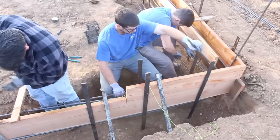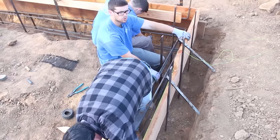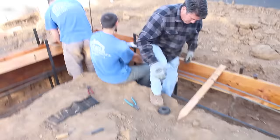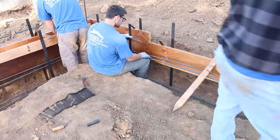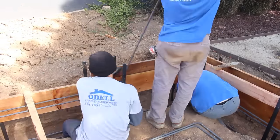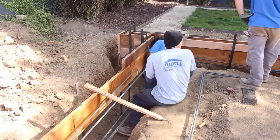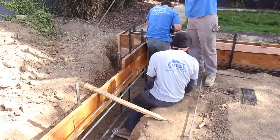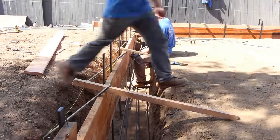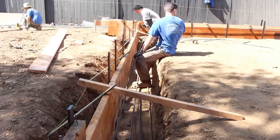Here's what it looks like when it's getting hung. You need at least a two-foot overlap with five-eighths rebar, and you can get down to 18 inches on number three or two foot on number four. In areas where I had no stem wall to hang the rebar from, I just threw some three-foot wood stakes from the dirt to the top of form and I'm hanging the steel off of that. At these door openings, we're discontinuing one of the sets of number five rebar since the top two are in the stem wall and there is no stem wall across the doorways — they terminate at the ends of the stem wall door opening.